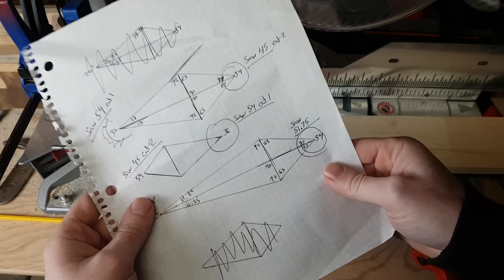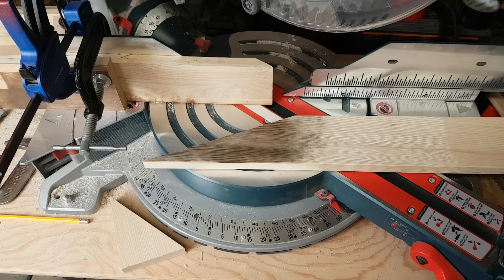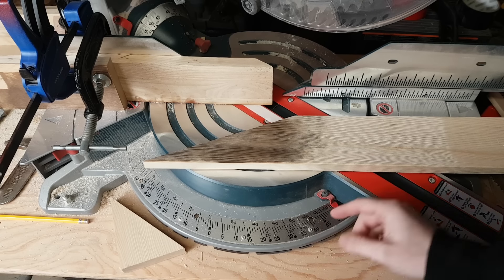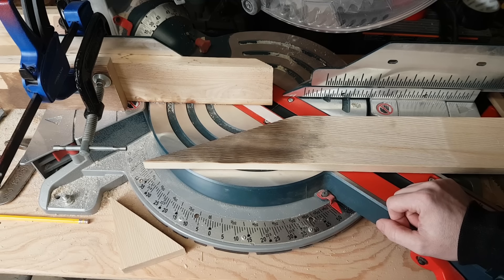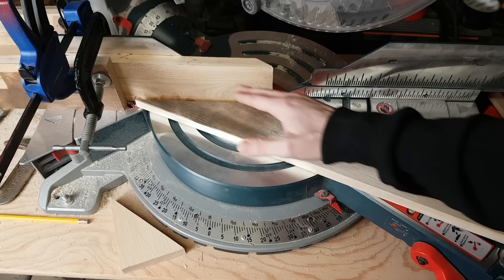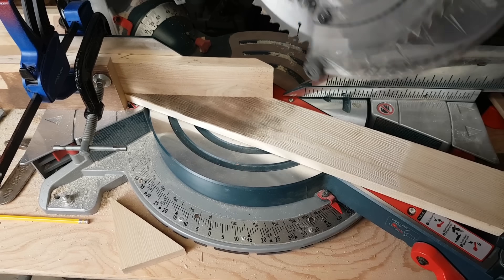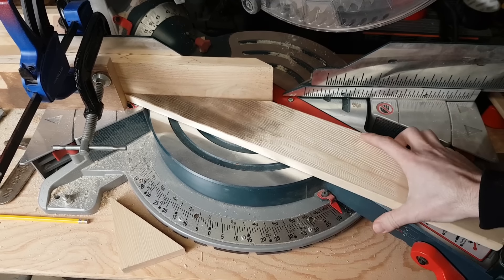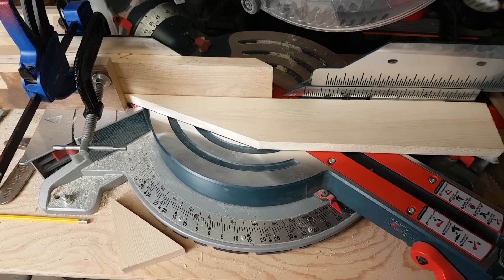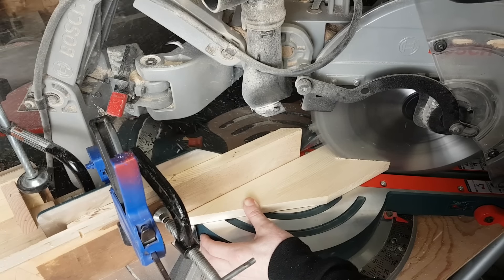Now I'll show you how to make the next cuts. According to my calculations, I need to set my saw to 51.75 degrees. Getting that right on a miter saw is kind of difficult, so I put it to 52 and backed it off a little bit — that's probably as close as I'm going to get to 51.75. We'll just kind of wing it and see what happens. To line this up, I'm lining up this corner with this zero clearance fence. I'll flip this over, make the first cut this way because there's less wood to cut there, then flip it over and cut it again. Hopefully it fits.